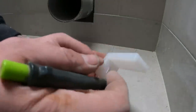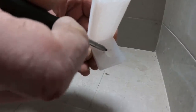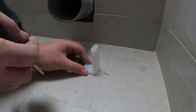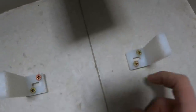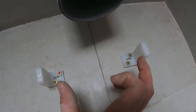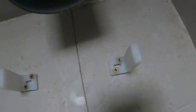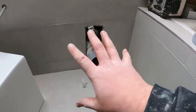What I also do — a few people I know do this — is drill a hole there and a hole there. Because if you bolt it on that center piece it can slide back and forth, move like that. Whereas if you bolt it through there, it's going to be solid. Fixing those brackets down with the double screws is perfect. If you use that middle one they can slide as you're tightening it up — this side and this side — if they're not properly secure those brackets will just slide out and in. Whereas with those four screws in, they're not going anywhere. So we'll now get this pan in — I'll swap this out for a flexi, get it all in, and push it back in and get it screwed through the side.